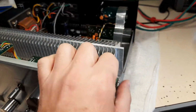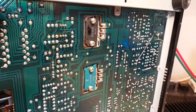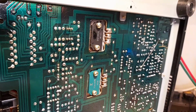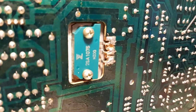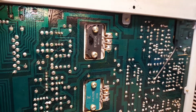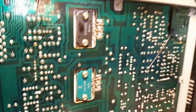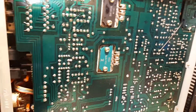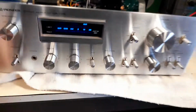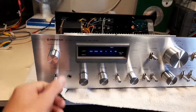If I can just gently lift the amplifier up, there you'll see it's Fairchild, well, in this case Fairchild transistors, but some of them were equipped with Toshiba output transistors, and I believe you also got Hitachi transistors in this package. So to fit modern equivalent output transistors will be a little bit of a thing, but it can be done and you'll retain the performance. So if you can pick one of these up for a good couple of money, then do it.